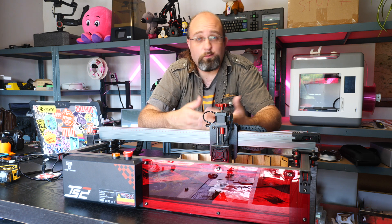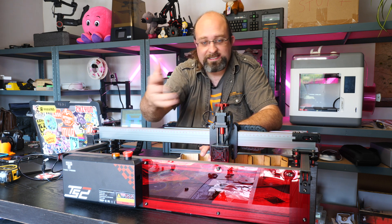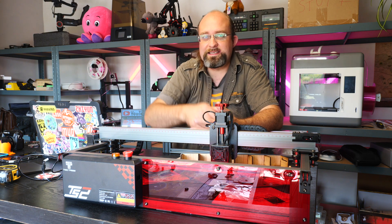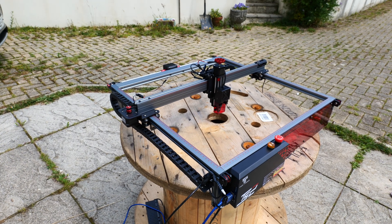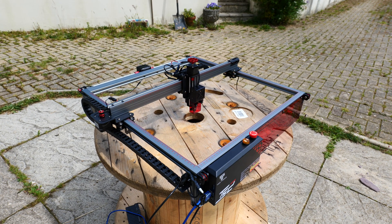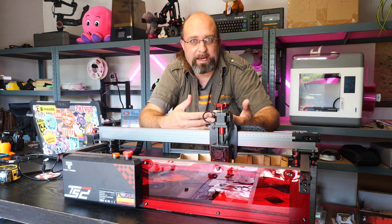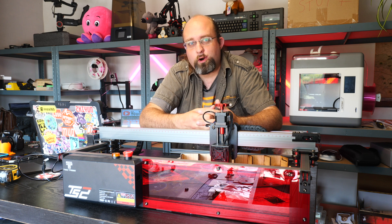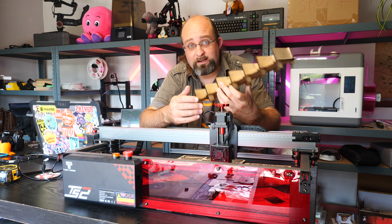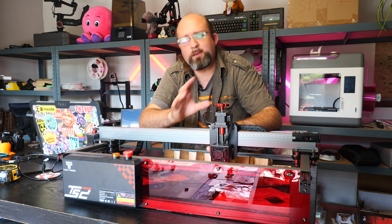It's just overall a very smooth experience and very well built. Beyond that, it's a matter of finding out what settings work for you and the materials you're working with. It's not perfect by any means — these rulers on the side are basically unrelated to the operation of the machine. They're a useful feature to have, but they don't correspond, and it would have been really nice if they were aligned to the zero point of the laser engraver. At around $700, you really need to think about whether you need it to be this big. The autofocus is nice, but if you don't need that size format, there's very little reason to go above $300 to $400. You could buy something just as powerful with a 10W laser but not as big. However, the size does really open up your options — in the past I've had to cut projects in two halves or give up completely because they were too big. So think carefully about whether you need it that large.